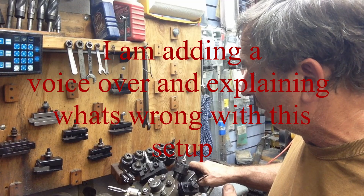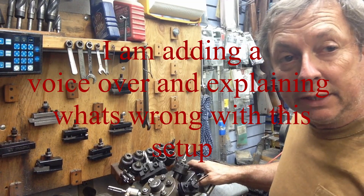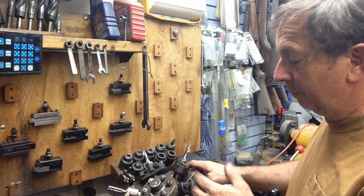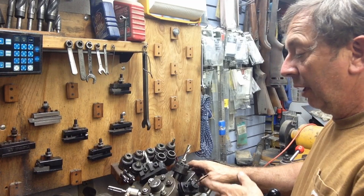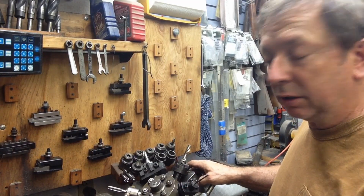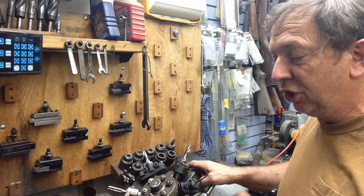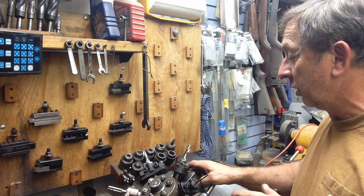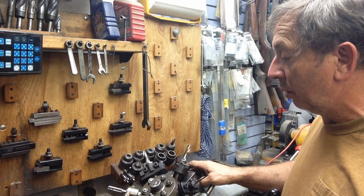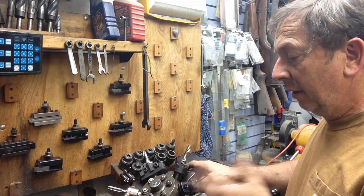Position 1 we're using as a stop. Position 2 is a center drill, and I'll probably before we actually start machining go back and see if I've got a fresh center drill — this one's dull so it needs to be changed out. Then we're drilling a guide drill, just a small one, looks like about an eighth inch. Then we've got two drills going through to actually drill our hole and then flat bottom it. And then we're going to tap it.